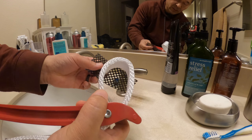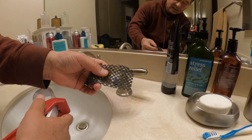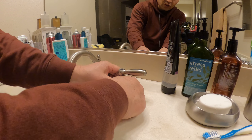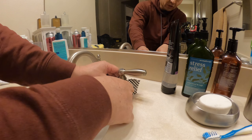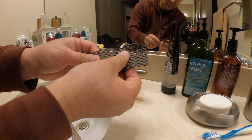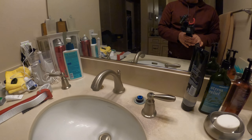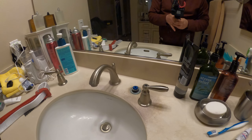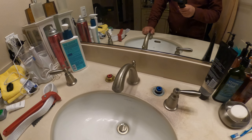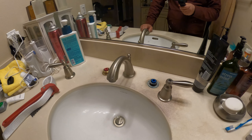If the tool doesn't work for you, add friction using a rubber glove or jar opener — just enough to add grip. The tool tray liner worked for me because it has some tackiness to it. That's the trick to getting this handle out. I used the same trick to remove the other handles in my bathrooms, which after about 10 years are all getting more difficult to turn.